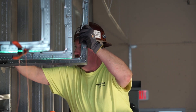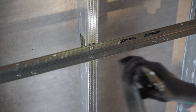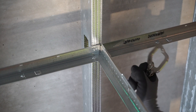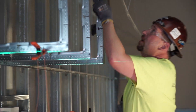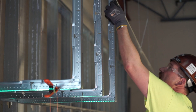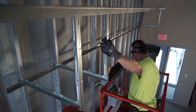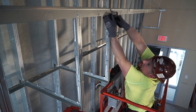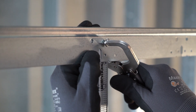We are using a different type of utility angle at the walls for this build. LAM locking angle molding has locking tabs on 8-inch centers that helps us space and lock our tees on 16-inch centers without measuring or marking the angle. After locking the tee at the wall, simply level, clamp, and screw attach to the Strongback while aligning the center of the Quick Stick tee with the 8-inch on-center routed screw location on the Strongback.